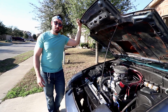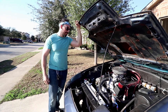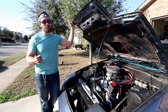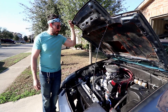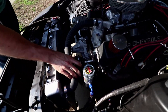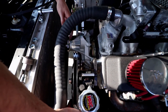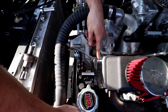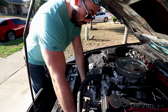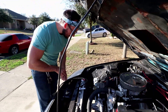One of our subscribers - I'll put his Instagram below, Rick if you're seeing this thank you - gave us a tip about using washers. This might not be the most legit way to do it, but I think I found a modified way to still make it work. I found the power steering pump pulley was not lining up properly with the crank pulley, which meant I'd have to shim out that pulley. So we're going to adjust it using washers to push it in and line it up better, and then we may not even need to shim the water pump pulley at all - or if we do, it'll be a lot less. Trial and error.